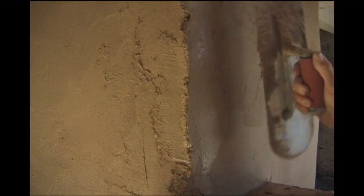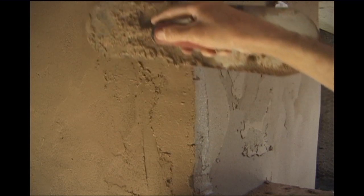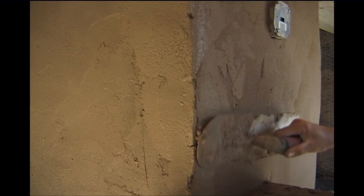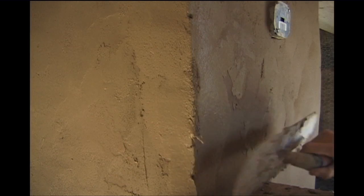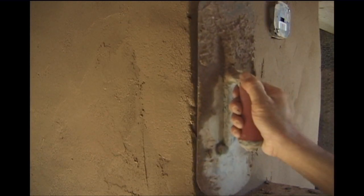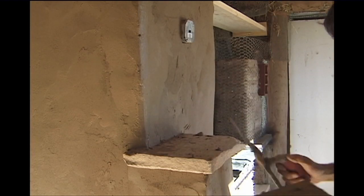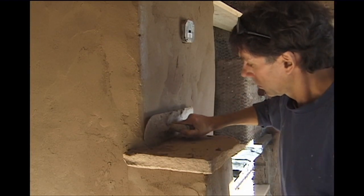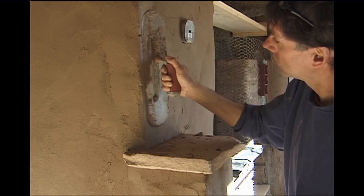This is like working with chocolate frosting — it's got a great texture. You push hard with a trowel and you can get it perfectly smooth. It's like pushing a clay block around, and you have a tremendous amount of latitude in the shape. You start looking for slight imperfections and accentuating those, because with an adobe wall you do not want it perfectly plumb or with perfectly hard edges — you want it to look like it's been worked by hand with some expression in it. Keep working back and forth until you get a shape that feels right. We're not going with a real thick coat — just thick enough to cover the stucco lath. Half an inch to three-quarters of an inch is perfectly thick enough in this case.